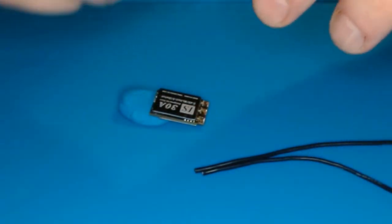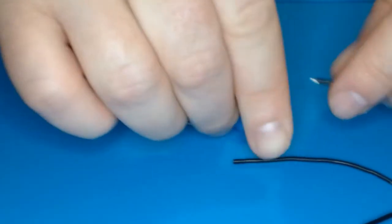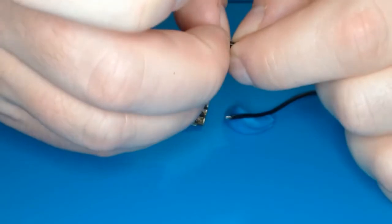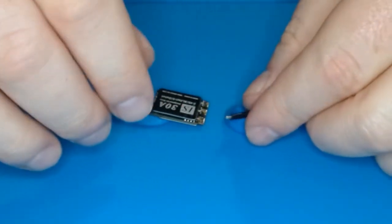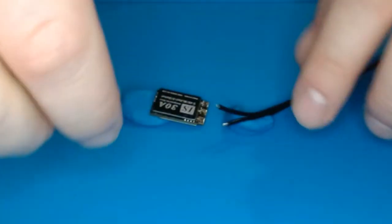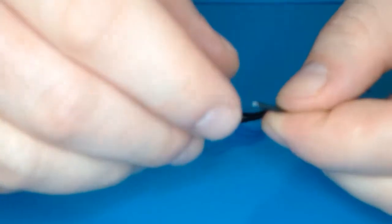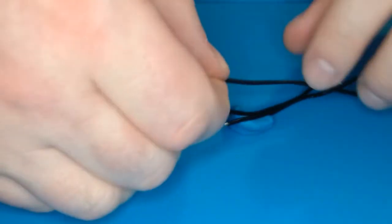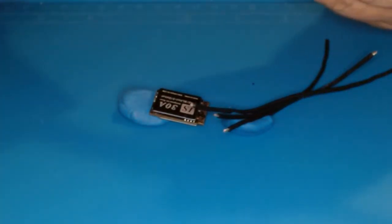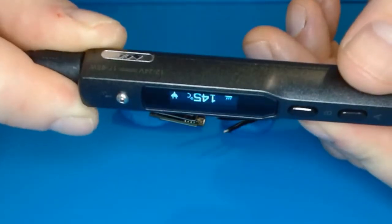After I've exposed the wire I'll twist it, then set it up on some fun tack so that I can tin the tips. It's really important to not expose too much wire — it's a common mistake beginners make. If there's too much exposed and it's sticking off the end of the pad, you're at high risk for shorting your components. We're going to be set at 425 degrees.